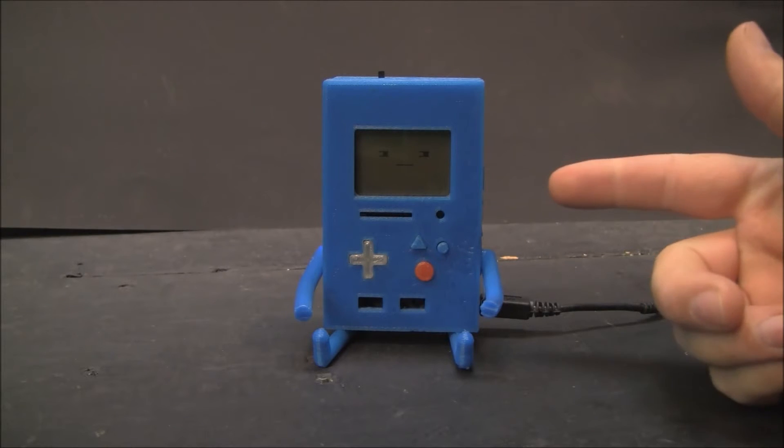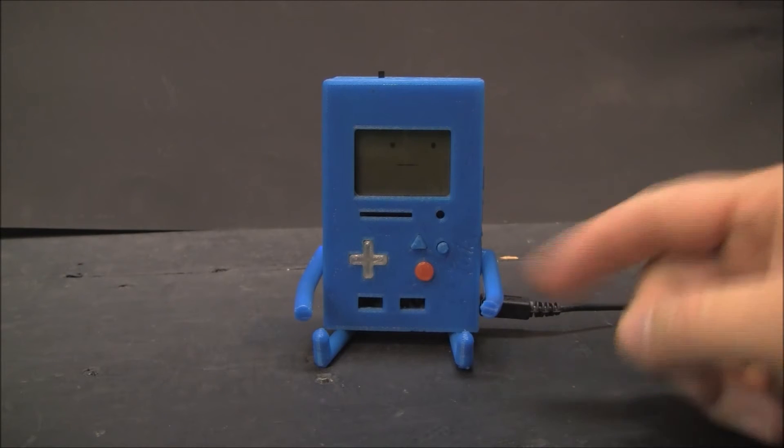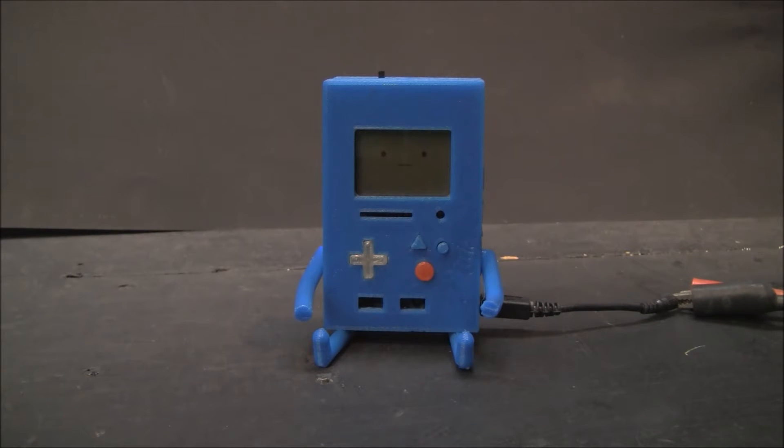Right now I've got an accelerometer with two axes hooked up. I have an infrared distance sensor, so she'll see you coming from a few feet. There's an inactivity facial expression loop so she'll look around, and there are also some random voices every 30 seconds to a minute or so, randomized. And then if you've been gone for at least 30 seconds to a minute and you come up, she should give you some kind of a greeting.